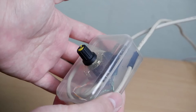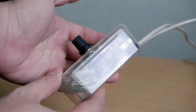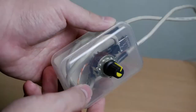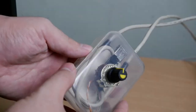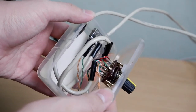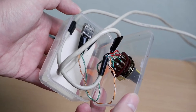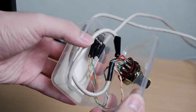This is our DIY USB switcher device, made out of a thin plastic box and a four-pole three-position audio selector switch. This switch is used to switch four USB wires between two computers. The flip-out cover allows for easy cleaning of the selector contacts by spraying with a contact cleaner spray.